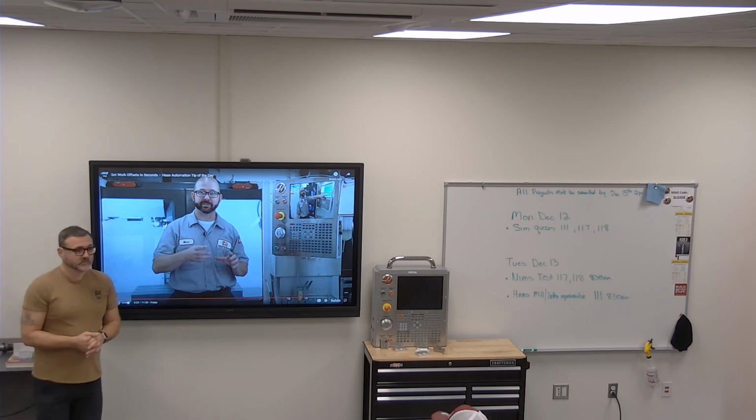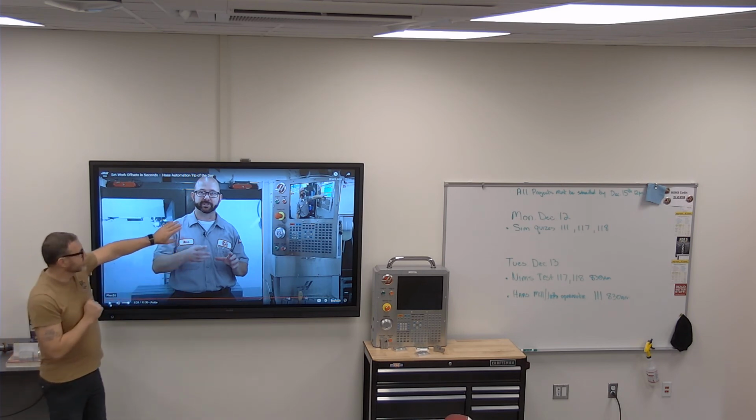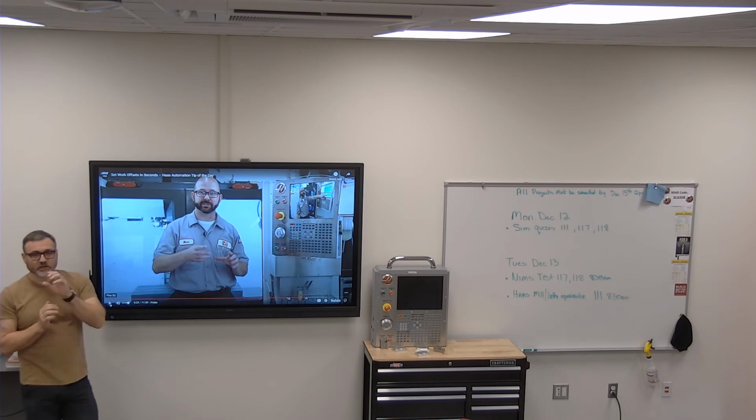But you're still probing them every time. I would have to probe them every time. Yeah. You told me to just use my edge finder and do it myself. What's that? And in the actual program, to probe it before it starts. Exactly. So you can take this probing cycle that it puts in MDI, copy it to the clipboard, insert it into your program, save your program, and then it's just always there. So it does it by itself.